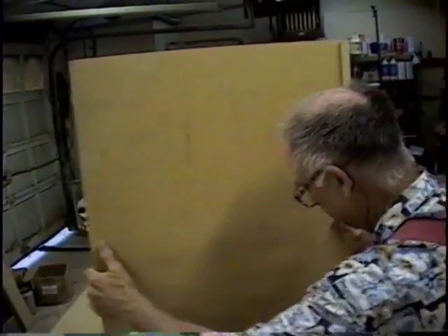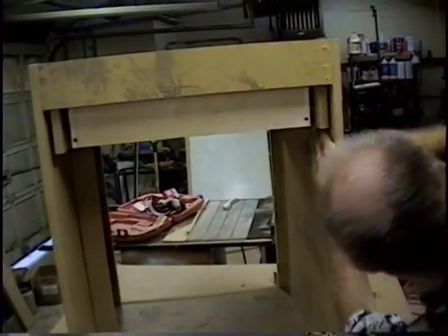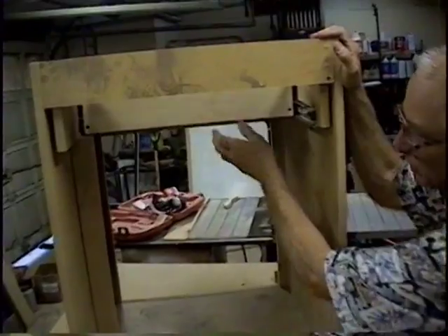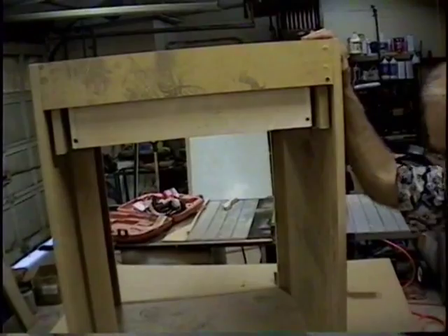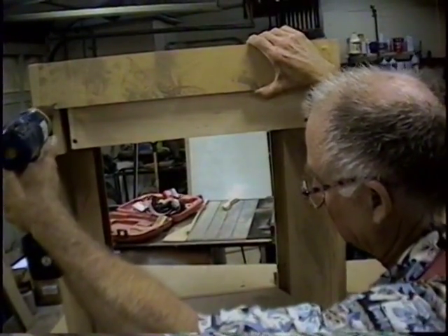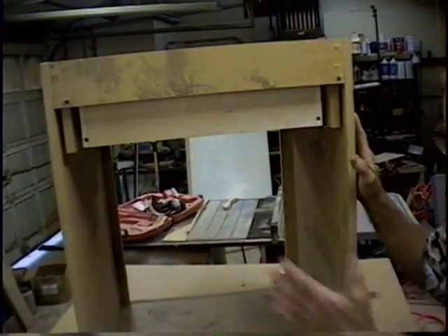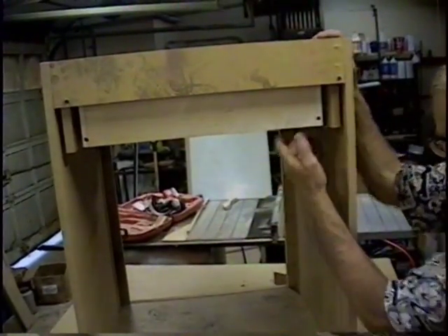Spin this back around and drag this back over where it was. Got a screw in there. This side here is automatically going to be where it needs to go from the drawer all the way back. Now we can run a couple of nails in there, or screws, whatever you want to use. In this case, we can just put a screw in there. That's set. Now you do want to run some nails or screws in from the side once you get everything set, so these have no chance of coming loose — in case you put heavy load in here. You don't want this thing to fall down.